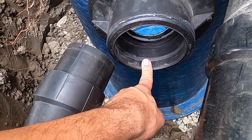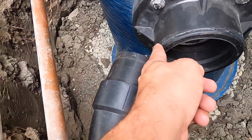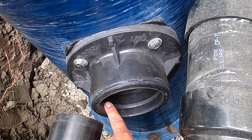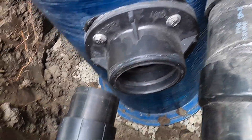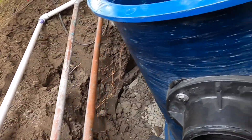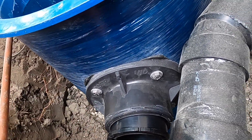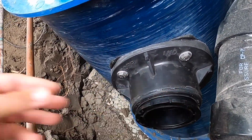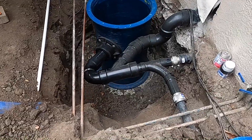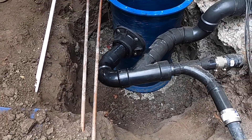Here's the basin — it comes with a rubber gasket that reduces it to a four-inch, just a push-in thing. The company says just push it in, but I've added some silicone for extra security so the water doesn't leak. Since I'm dealing with three-inch pipe, I've got a four-by-three ABS bushing that I slide inside the rubber gasket, and I'll add silicone to that as well. Then I glue in a three-inch ABS pipe, and when it's all glued together you can see the slope on all of this pipe going into the basin, because it's all gravity fed into the basin.